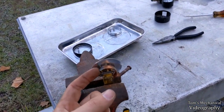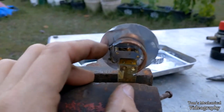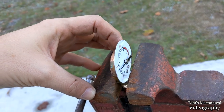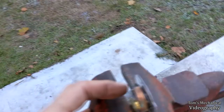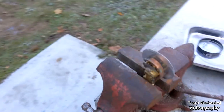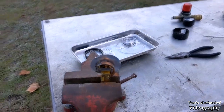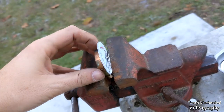So what we need to do is bend one of two things: this bladder right here, or this little arm right here. If we bend the arm down, that'll affect the gauge, and if we bend the bladder inward, that will also affect the gauge. The simplest thing to do is to bend the bladder, but the thing that's probably least likely to accidentally break your gauge is to just bend that little arm — and that's only if you need to move it just a small amount.